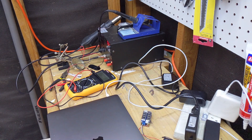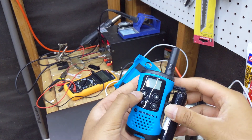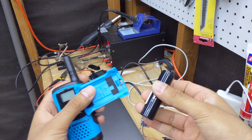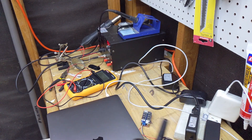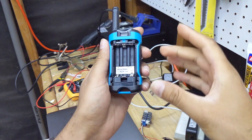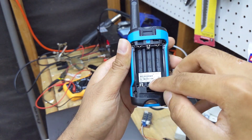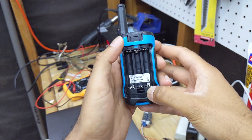Although we won't be able to fit the 18650 cell inside the compartment, we can zip-tie it on the outside and connect it in. That gives us a solution lasting about four times as long on a single charge — as long as you don't puncture the cell. First, we're going to confirm how the cells are wired in series: negative end to positive end, so the circuit runs from negative here to positive here.